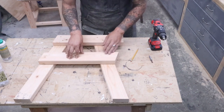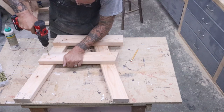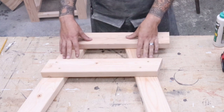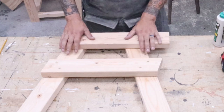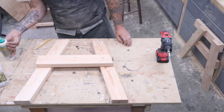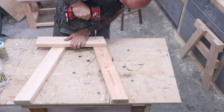If lined up properly, the bottom bevel will meet the leg. If it doesn't line up, make the slight adjustment needed, then glue it and screw it. This thing is looking sweet — this is the inside, so now we have to make a mirror image of this one so we have two sides that go together. I'll do the other side the same exact way, just facing the opposite side — line up the legs, put the arm support on, then the leg supports.